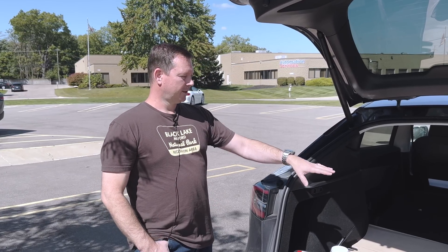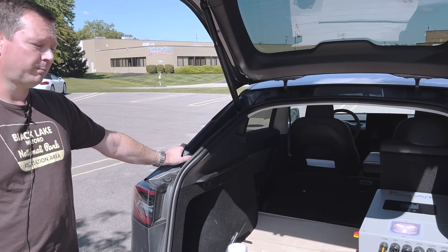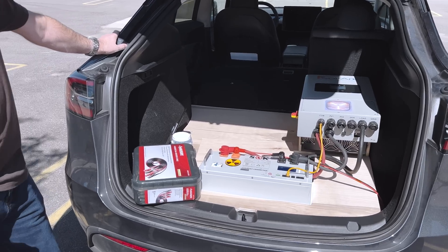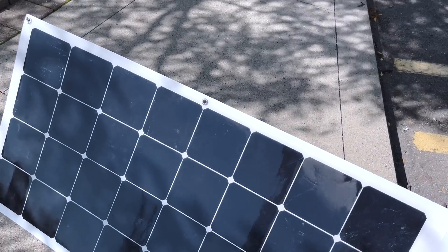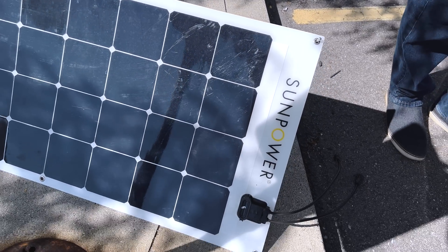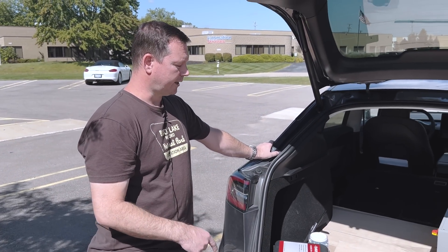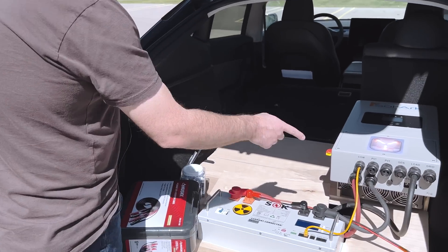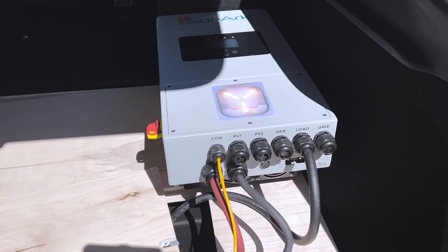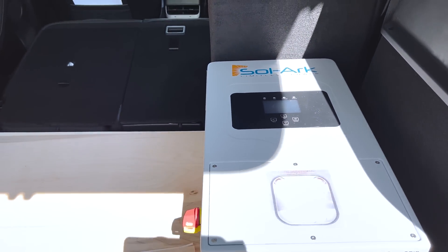That configuration fits well with this inverter — it's actually got two MPPT charge controllers. The maximum power point tracking will modulate the current on the panel to get the maximum voltage-current power output, then convert that into the charge voltage for the battery and back into AC. I haven't done a round-trip efficiency test on the panels yet, but I have done it on the battery. Going from DC to AC and then AC back to DC to the vehicle, I'm about 80% — which is actually pretty good for all those conversion losses.